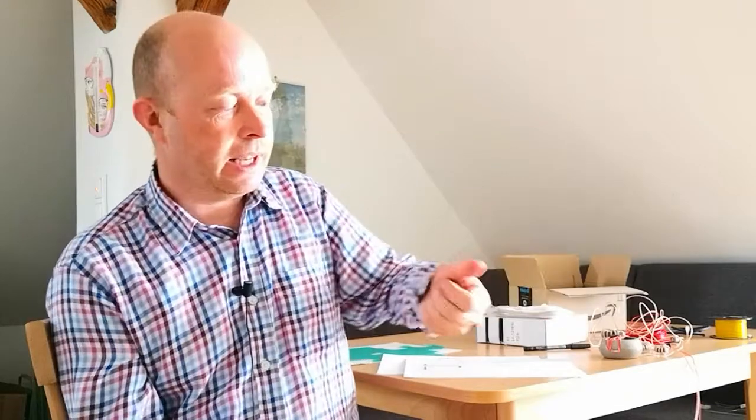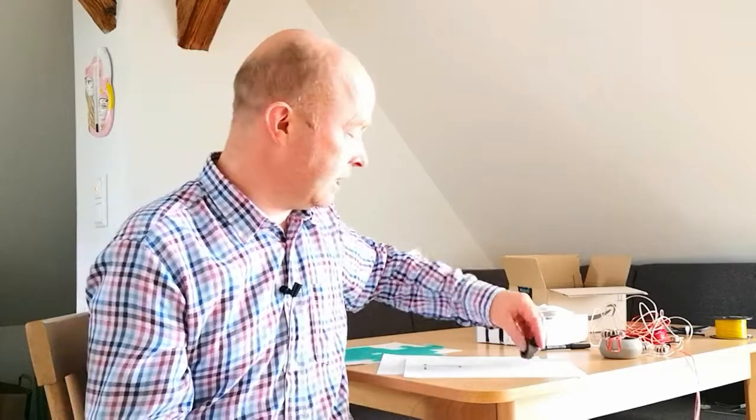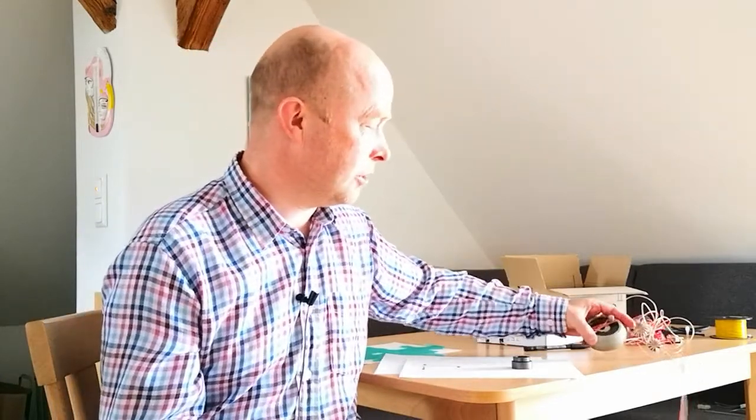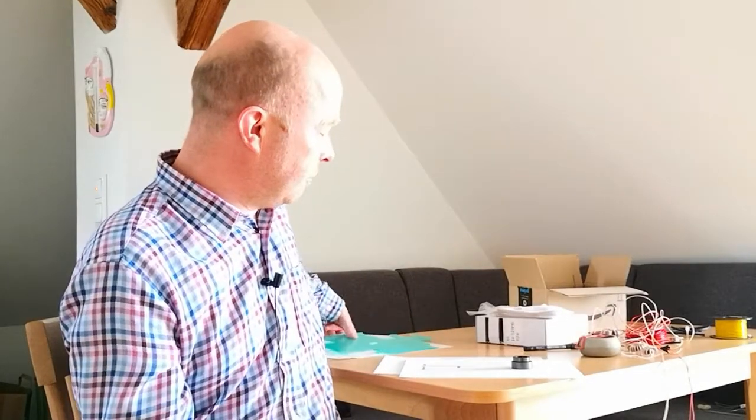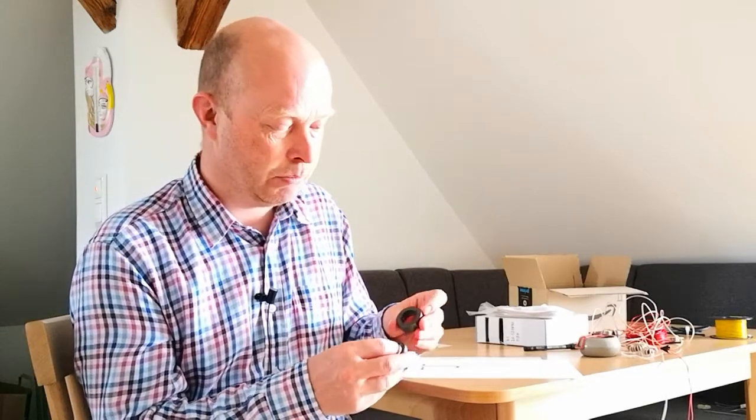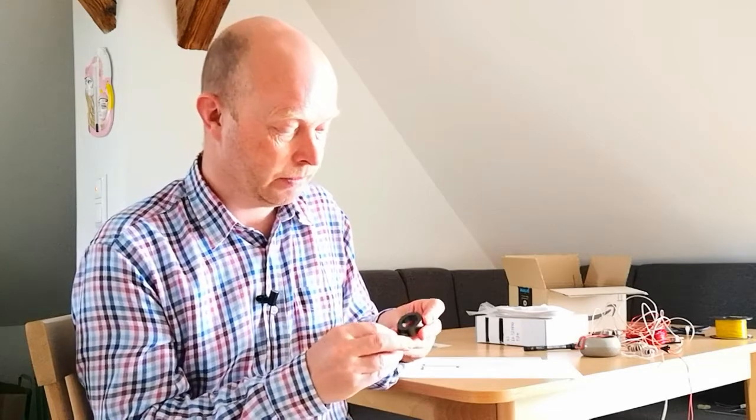Because I'm wanting it to radiate now on 60 meters, radiate on 80 meters as the lowest band, obviously I need a bit more impedance. I don't think that would be very good for 80 meters. It's not going to be enough, so we're going to use more impedance, and for that I've got these two ferrites here. Now I've got back to an FT140 43 and an FT114, and they're going to sit like this. That should hopefully give me enough impedance on 80 meters. But generally, I won't be using it very much on 80. More often I'll be using it on 60 and above.